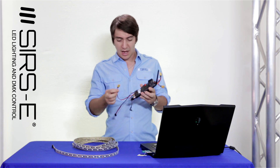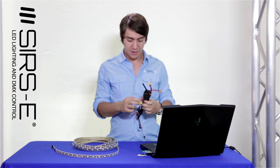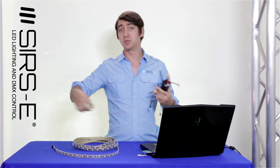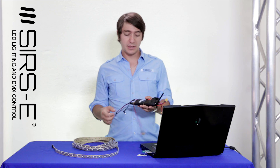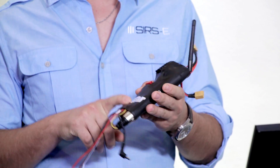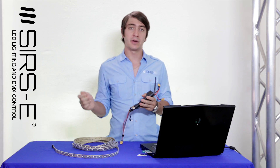In this case I also added an extra 5-volt output so I can run a wire to the end of the strip and power it from both ends when using a long section. If you don't want a cable running all the way down, you can build another pack with just a regulator and a battery — no DMX components needed, since it only needs to power the far end of the strip.